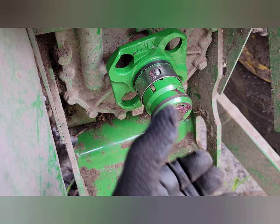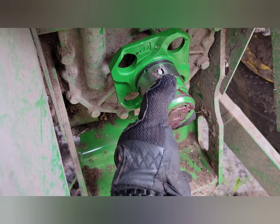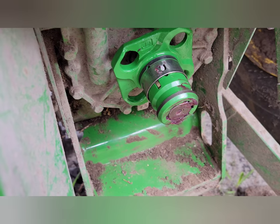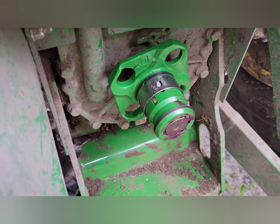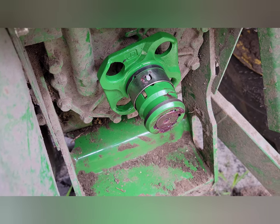This metal ring here is down, and that's where it goes — over that part where they usually quick connect. The PTO actually slides onto that, sits there, and then you have to push this back to lock in place. Now that's in there and it ain't going anywhere. So the other half of the PTO quick connect just clips onto that, slides right on, and you're ready to roll.